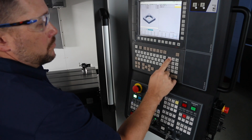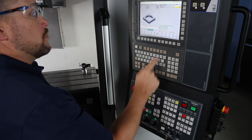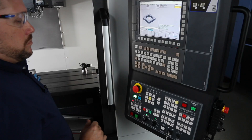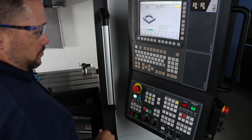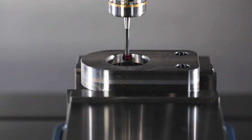Press input and fill out the diameter box, then press input again to follow the GUI message. Now I'll put the machine in hand wheel to position the probe in the center of the bore as the instructions indicate. Press the memory hard key and finally press the cycle start button.